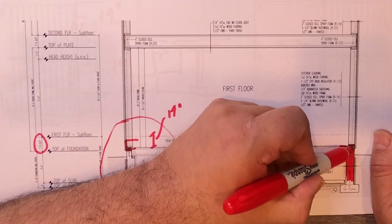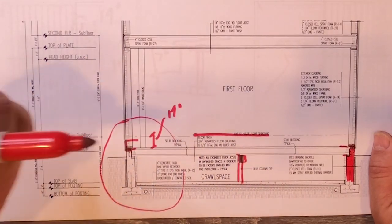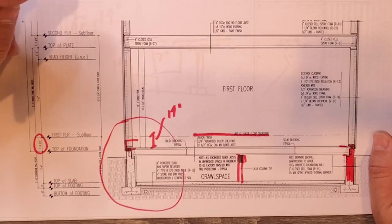The bottom of the upper floor joists aligns with the top of the lower floor joists — that's how we do it. You take that little bite out of the foundation wall, build a shelf in there, and instead of sitting on top of the foundation wall you're sitting adjacent to the top — dropped 14 inches. Things align, I'm happy, and most importantly our client is happy: a nice easy transition into the mud room, a couple steps up into the main house, easy to negotiate, inside so no maintenance, and the ability to change from tile to wood floor flooring at the transition.